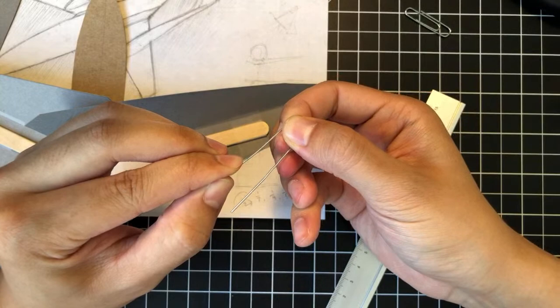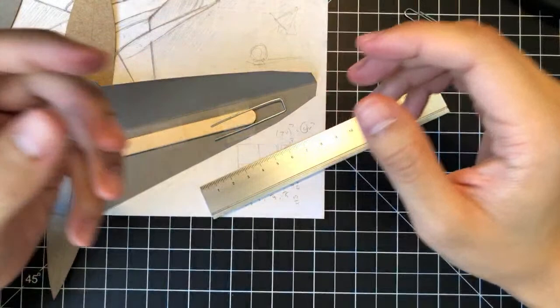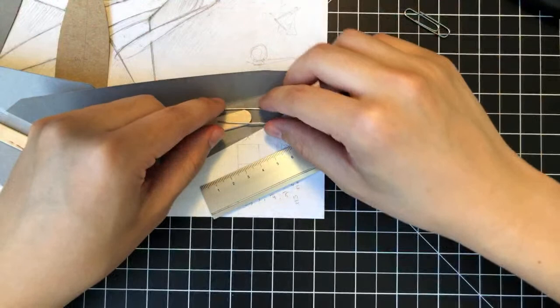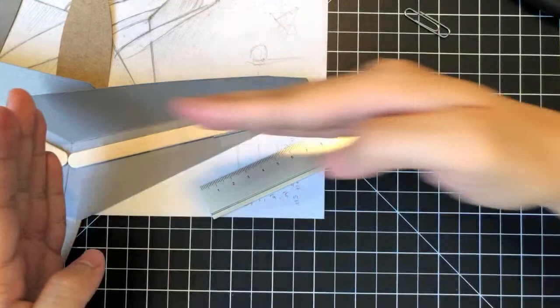But it was a very interesting project because it allowed me to test out new build techniques, right? You use insulation foam to shape the fuselage, and what's really nice is you can use disc sanders, and that was my favorite part, using disc sanders to really shape some of the parts on the RC plane, like a twin boom, vertical tail, and a horizontal tail connecting the two vertical pieces in the back.